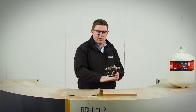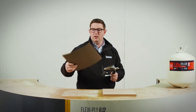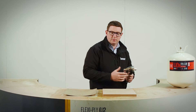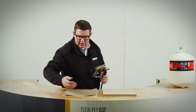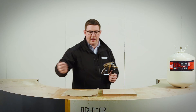L10N is used for bonding laminate to MDF. This is a standard 0.9mm laminate — 0.8mm onto MDF substrate. First things first, we're just going to make sure that there's no dust or surface debris on either surface. Normally use a brush or an airline, something like that.